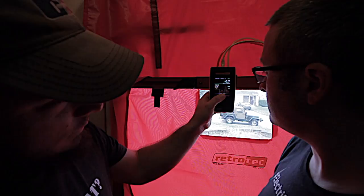So I've done a blower door test on this house before, but I didn't get any video of it. So what we're doing today is getting a total leakage of the house. We're also going to do a duct leakage to outside test so that we can see how much the leakage affects the total leakage of the house. So the first step is going to be blower door numbers with the ducts sealed. And then we're going to run the duct tester to show how much leakage goes outside. So you'll understand where the leakage is. Exactly. Much better in the house. Yeah. So this will be a good diagnostic test today. I'm looking forward to it. Awesome. So we're going to set pressure for the blower door at 50.